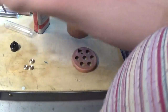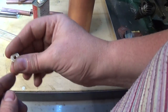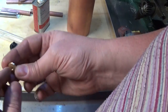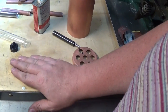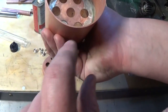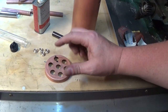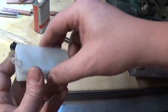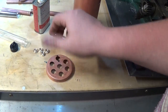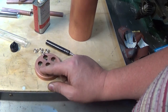Then drill them and tap them - I use Phil's tap guide, which is really nice - to run the tap through, part them off, and when they're all parted off turn them around in the chuck so they're up against the jaws, face them all to the same level, and clean them up. They're pretty straightforward and didn't take long - probably 20 to 30 minutes to make them. I do need a bush for the blow-down, and a little top-hat bush about half-inch high with a 5/16-32 thread in the top for the safety valve.